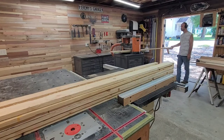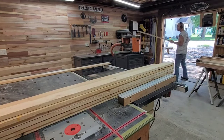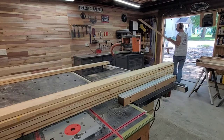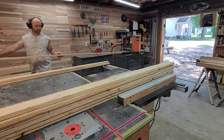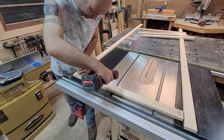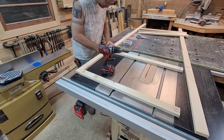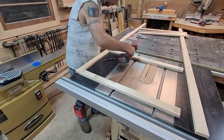Here's a little bit of footage of my planer cart in action - it's working fantastic. These boards are 91 inches long, started out around 7/8 thick, and are roughly a little over three and a half inches wide. Some of these boards that are now three-quarter inches thick got ripped down to two inches - this is going to be the face frame for this cabinet. The face frame is going to go together with pocket holes, and I'm using my table saw as a nice flat surface to hold everything flush so I get a nice clean look.